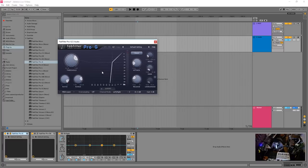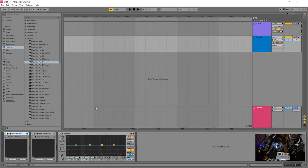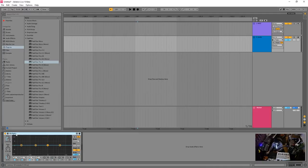You only want the audio to come through and eliminate the noise floor when audio actually needs to. A lot of this happens on drum kits — overheads, snare microphones — a snare isn't going all the time. If that audio signal is left on with no gate, noise will accumulate, so you want to keep it clean. That's really for conventional recording — a band, live, real instruments.